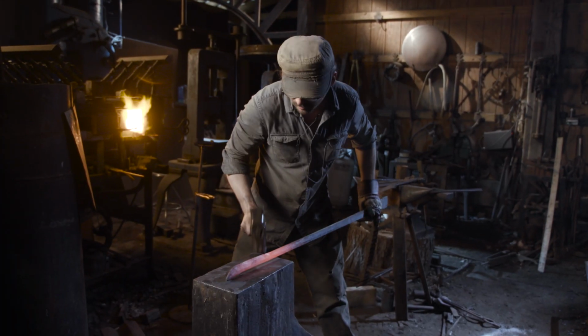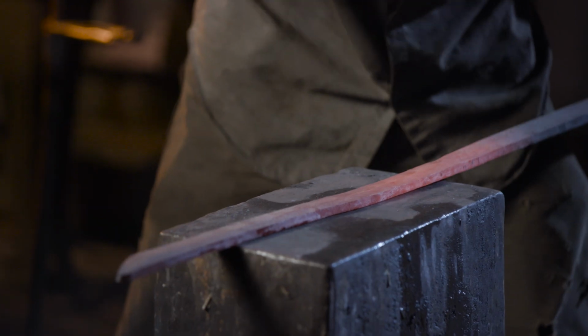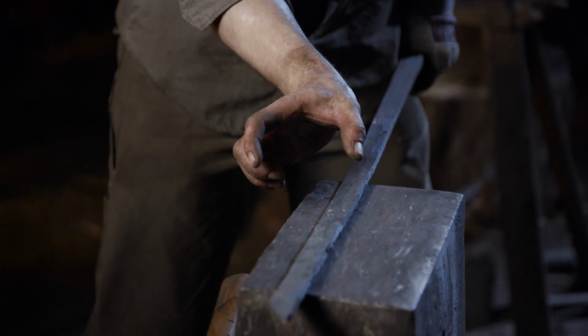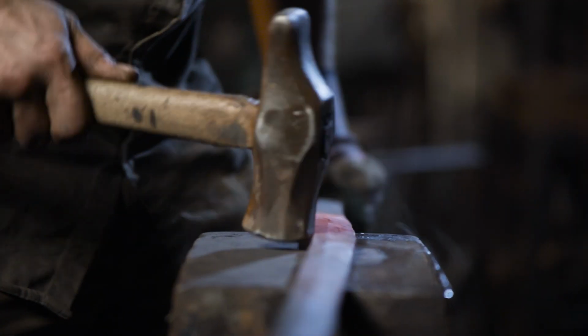And that's because I'm using the proper hammer technique. When you're hammering right, you're basically throwing the hammer through the anvil to the other side, and you're compressing the steel onto itself. And all the forces are equal between the hammer, the anvil, and side to side. As a result, the blade becomes straight. You can forge for much longer, since you're creating heat rather than losing it, and your Damascus pattern is nice and beautiful instead of ugly.